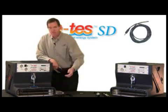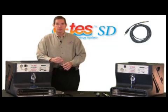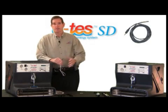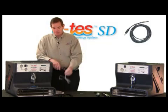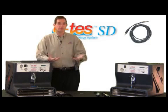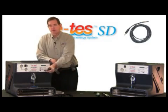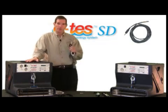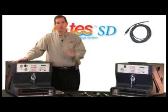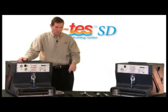Coming out the snout of these boxes, you might have 100, 120 degrees, and even more in some situations. But if you don't want the ambient air to get too warm, if you're pumping under carpet, under plastic containment, or just in the air, you can actually set the temperature sensor on your controls here that will turn the machine on and off. For example, maybe you don't want the environment to get over 95 degrees. This unit will allow it to control the machine. It will also document the air temperature. Remember, I told you there's an air temperature sensor built inside. This is a second unit, so you now have two air temperature sensors and readings that you can use.